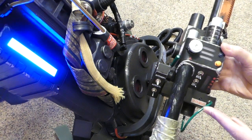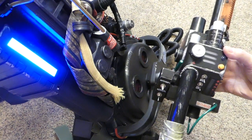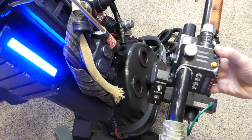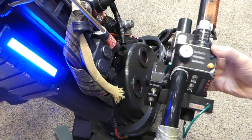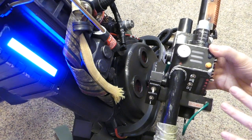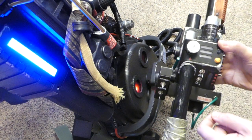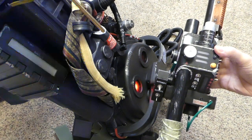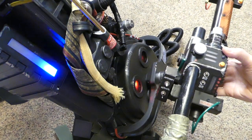Anytime the wand is powered on, it'll just stay on. You can turn it on, have the rumble motor going, and it'll stay on for as long as the batteries allow. The biggest limitation is if you use the fire button for a long time, it will time out and shut the wand down. But the circuitry inside that little board will keep the pack alive anyway, so you can turn the wand off and back on and the pack never knows a thing.